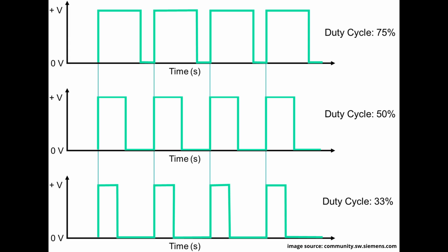To control the fan speed digitally, a PWM signal is applied to the fan's PWM wire. By varying the on time of the PWM signal, speed is increased or decreased accordingly by the fan's internal controller. The typical frequency is 25 kHz for most fans, but some do recommend lower PWM frequencies.